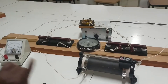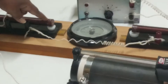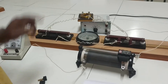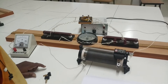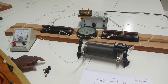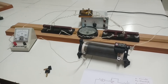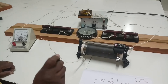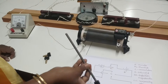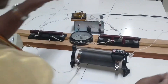To summarize setup: first, we set the tan A position; then the solenoid and compensating coil are placed 8 centimeters from the center; then we give the circuit connection. Now before performing the experiment, we have to insert the ferromagnetic material in the compensating coil. Before inserting, just tap it down to demagnetize it, then keep it in the hole provided.